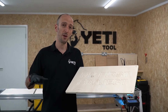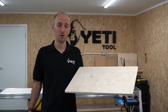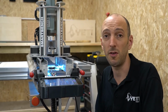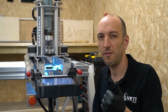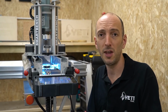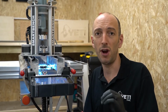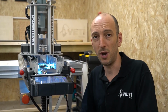So if you've got a low humidity workshop, you want to be particularly careful and consider elevating the moisture content in your environment. Secondly, heat. The cutter generates friction as it cuts through your material, and how you run your job affects how hot it's going to get. Getting your feeds and speeds right is critical to keeping the temperature low. Make sure you're making chips, not dust. Don't ever run blunt cutters because that will increase your friction. Make sure you're getting really good extraction so that that dust doesn't insulate the heat and gets evacuated.